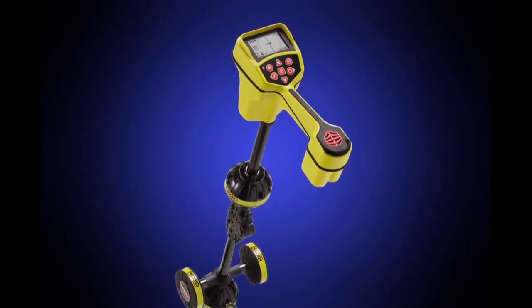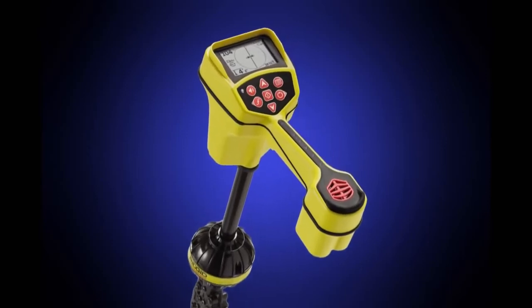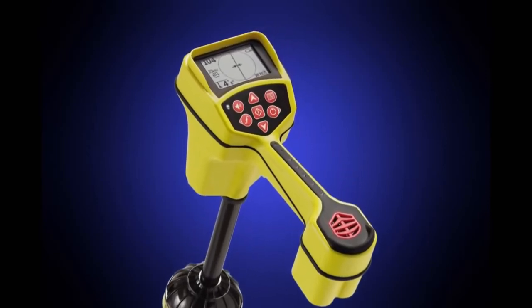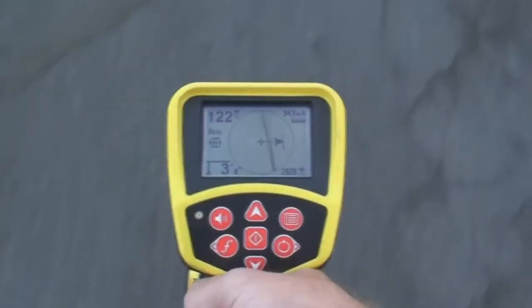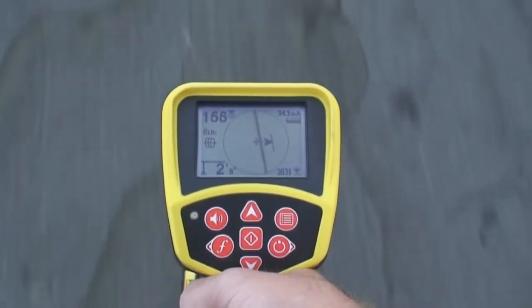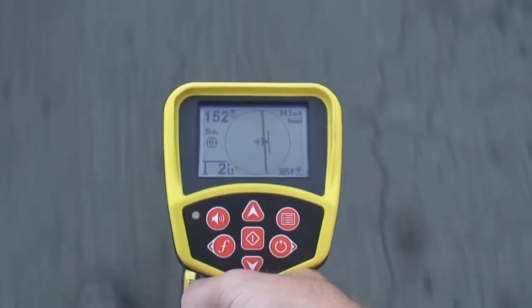They say that knowledge is power, and with the Ridgid SeekTech SR20 cable pipe and sonde locator, you'll know more about the signal than with any other receiver. When tracing buried utility lines, the SR20's signal readings show you the location, direction, and depth of locating signals, so you can acquire them quickly and easily trace their path.